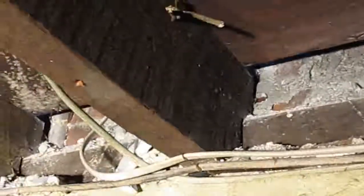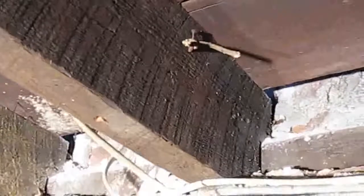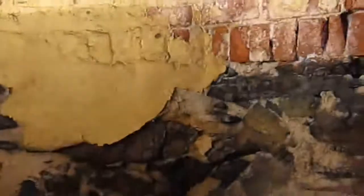You can also see how the floor joist here is notched over the wooden sill — just a two-by-eight rough-cut lumber. I'm going to assume we have oak here too; I've already taken one of the floor joists out and that was oak, so it was pretty solid. Looking a little further down, here's another view of what the slate looks like and how it's been plastered.